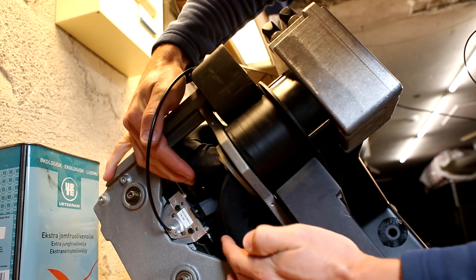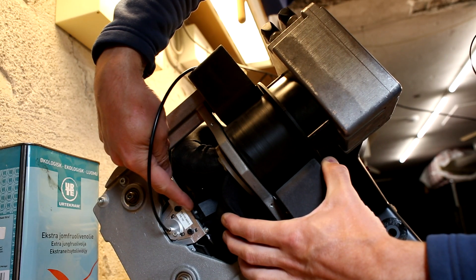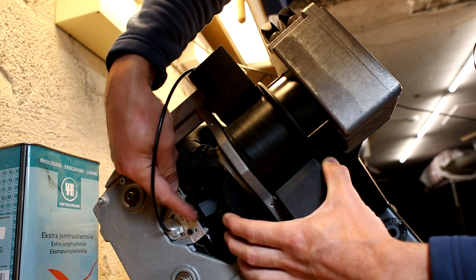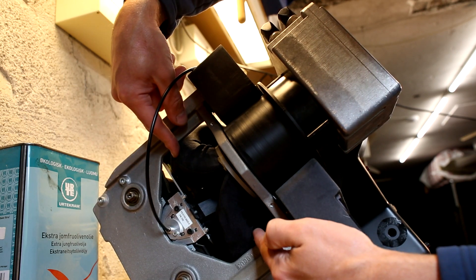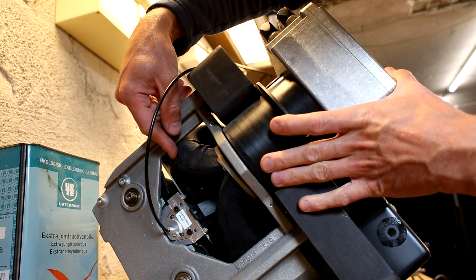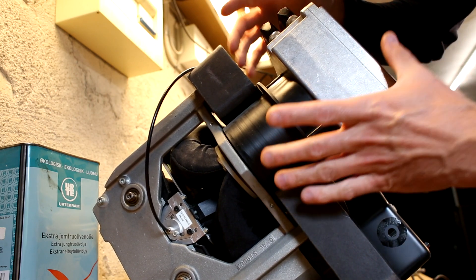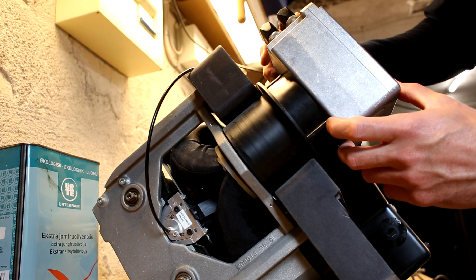We have the two large bundles of fiber optics here, and the funnel we have here is the scanning laser beam that goes over, hits a mirror behind here, and is returned through the two bundles on each side of fiber optics to the PMT, which is the gray box sitting up here. It is a complete assembly that can just be turned and taken off, so let's do that.